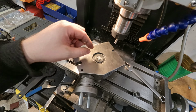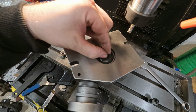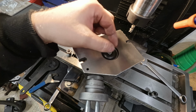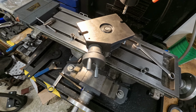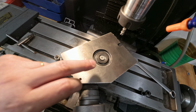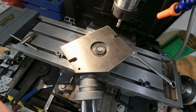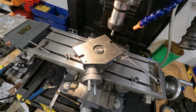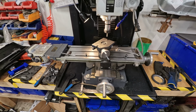Didn't need to look long. There's the reason: this screw rattling itself loose. So I need to tighten that up. I will find the right size bit for that. It's a Phillips PH3 probably, and I will use the impact driver to put it tight, and maybe it will work after that.